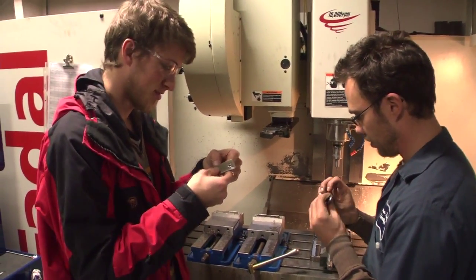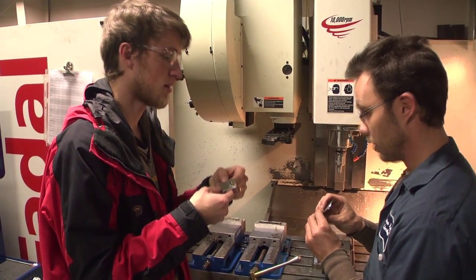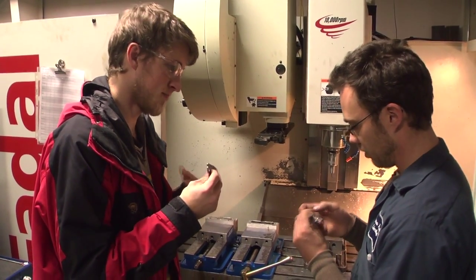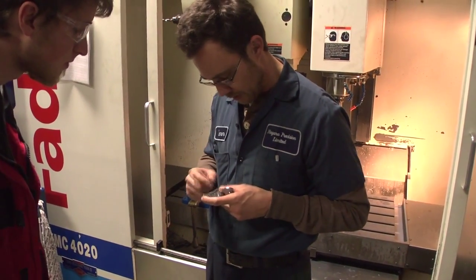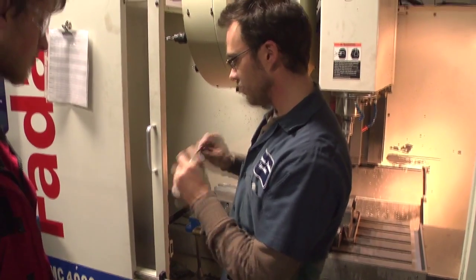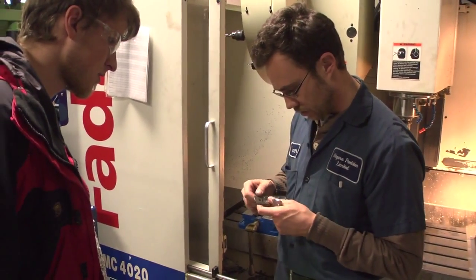All that is comp. The diameter of the cutter. Yeah. Programmed in the software. So it should come out about a thou. Yeah. Just to take that edge off there before I put it in, just in case there's a sharp edge. So that it sits in the jaw. Exactly. I don't want it to pick up on me. Yeah, it makes sense. So it's minimal.